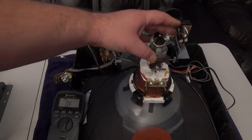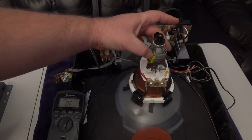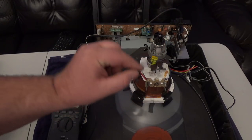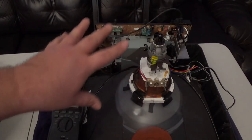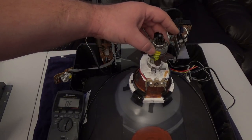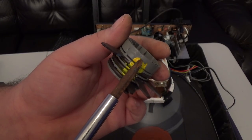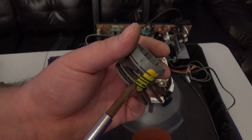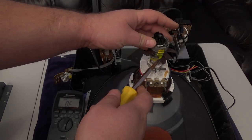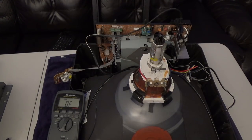You have three guns in the back of your tube, and these rings are little tiny magnets that converge those three guns to make one finite point on the front of your screen, which is then deflected by your yoke to draw the picture. At the factory they usually put a paint mark across this — if you keep that paint mark matched up, you don't have to re-mark the neck. I'm going to pull this off and remove the yoke.